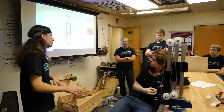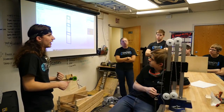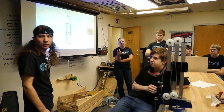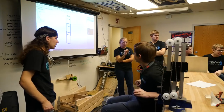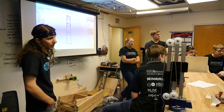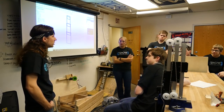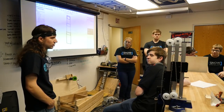One downside of a cascading three-stage lift is that the tension required to pull it is three times the weight of one stage. Given the light weight of these crates I'm not too worried, but if it proves to be a problem we can convert it to a continuous lift, or do a hybrid where the first two stages are continuous and the last is cascading to get benefits of both. That's not unheard of.